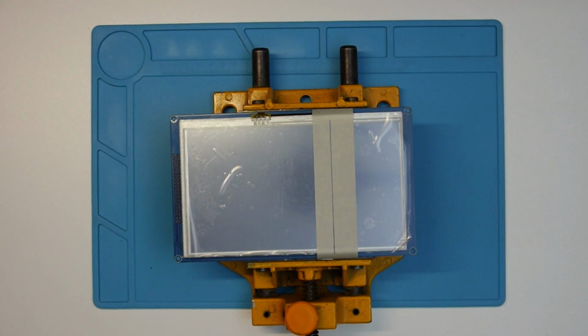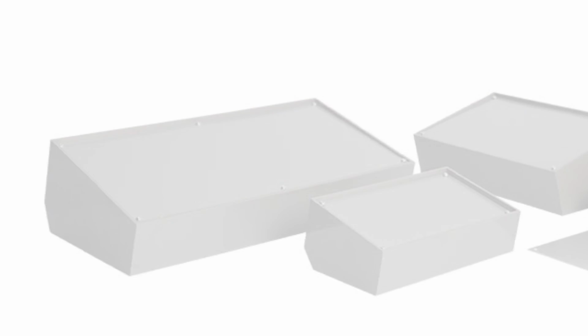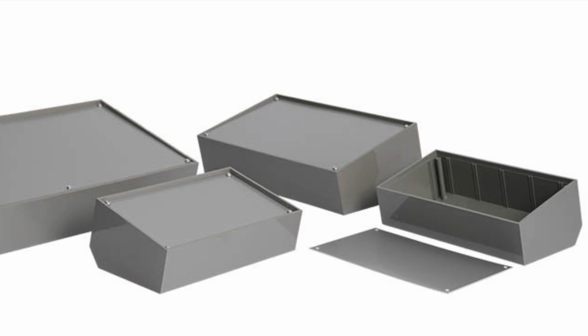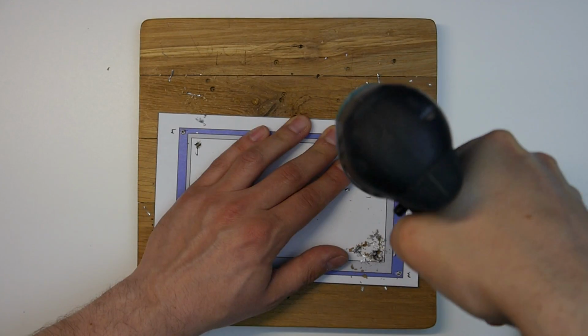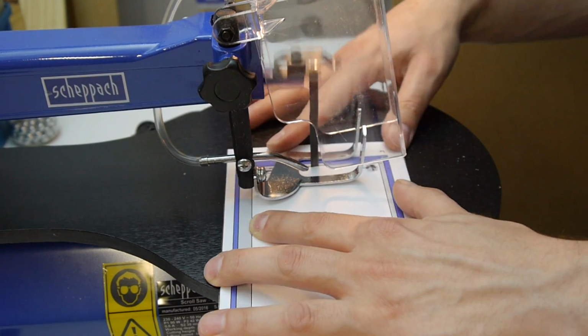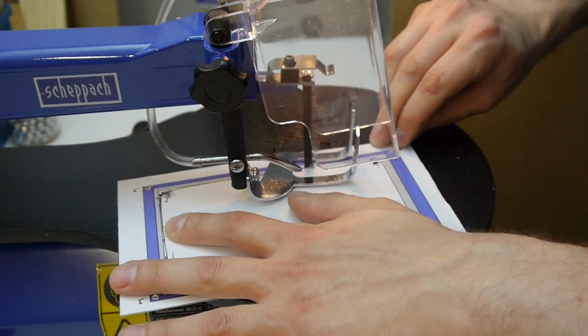No, of course not, even though my approach might get me excommunicated from some RepRap communities. I bought a prefabricated case with an aluminium front plate, took that out and glued a template onto it. After drilling the necessary holes, I used a scroll saw to rough out the cutout for the panel, filed the edges to size and then mounted the panel to the front plate.